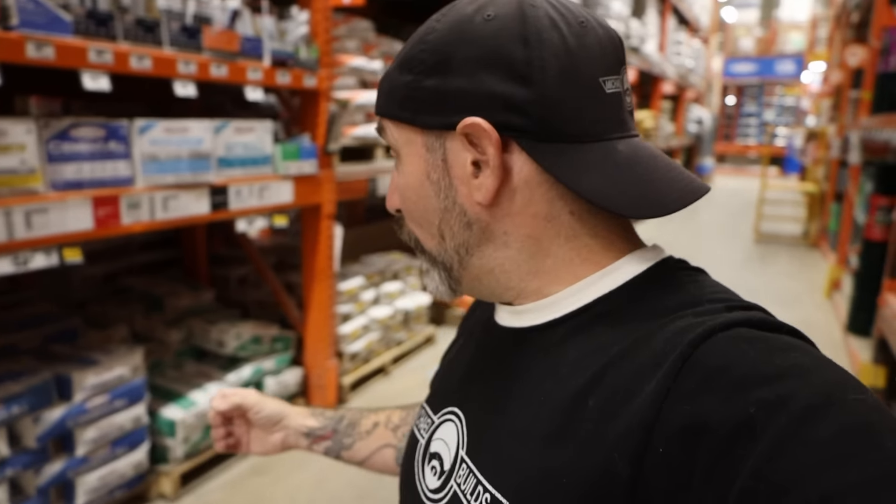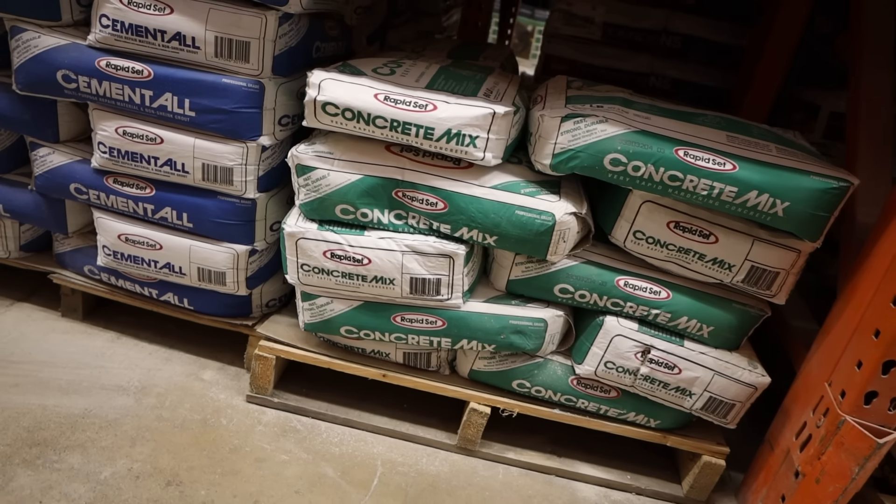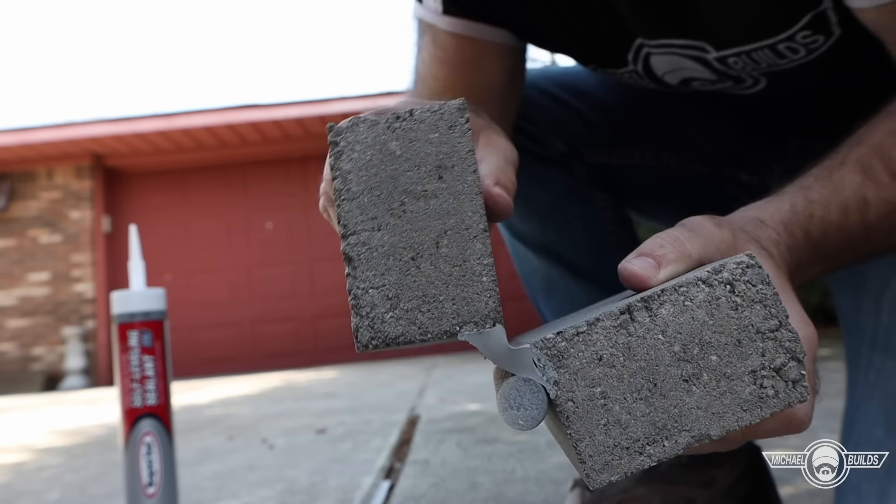If you don't need that feathered edge, stay away from Cement All — you can go to mortar mix, from a half inch to six inches thick. But again, we're getting bigger in aggregate. If you need to repair a very large void from the surface down to the earth, that's where the concrete mix can come in. If you need your repair to be flexible, that's when you want to start thinking about the sealants. And if you're still having trouble, look at the back of the product — it will tell you everything you need to know, including how thin and how thick it goes.